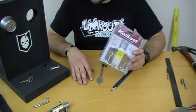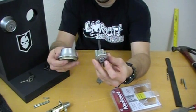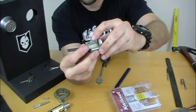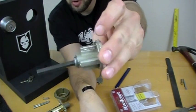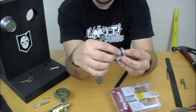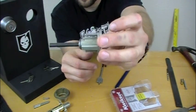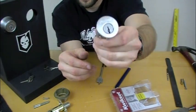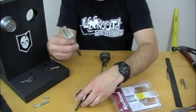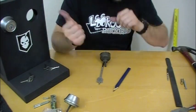You've got to be careful about the cheap stuff because this is a mortise cylinder, and some of the cheaper deadbolt sets will not have this removable plate right here, so you can't pull out some of those pins. We'll probably go into that in another video. You can remove pins to make picking these mortise cylinders a lot easier. You want to look for these mortise cylinder sets. You need two of those so you can do a right and a left, just like I showed you on this stand.